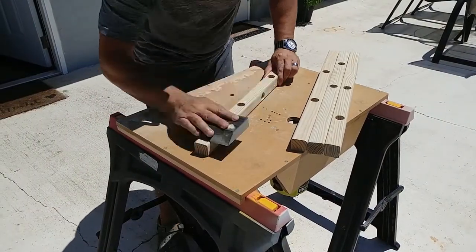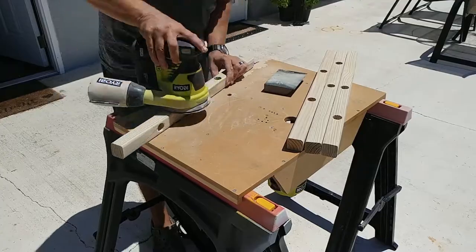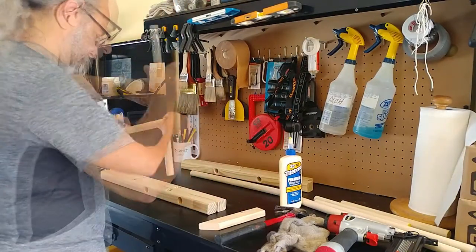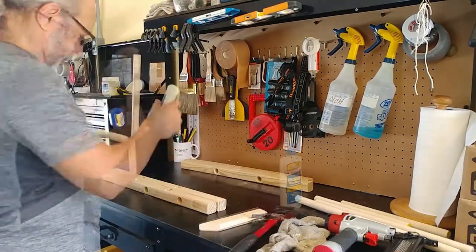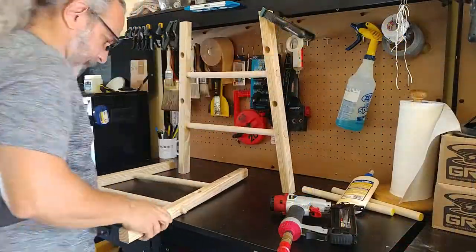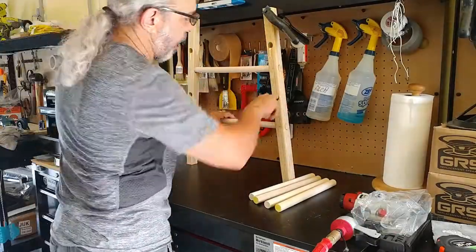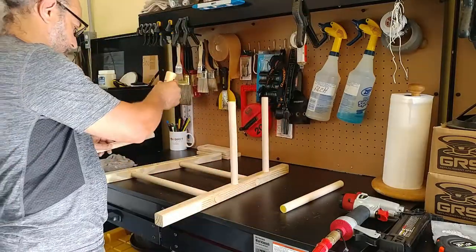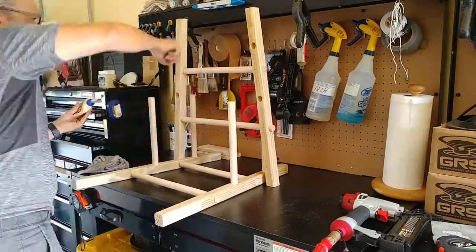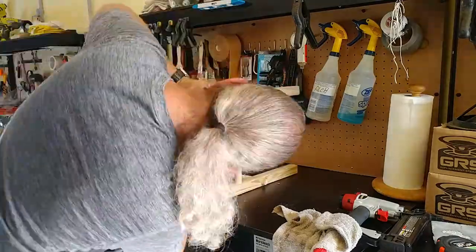Because this is low quality wood, a good sanding is highly recommended, unless a rusty look is what you seek. I did one pass with a 150-grit foam pad and eventually a 220 pass with the orbital sander. For the assembly, all we are doing is fitting the dowels into the holes with plenty of glue and pin nails to hold everything in place while the glue dries — but if you have patience, the pin nails are 100% optional. I use TiteBond II for 90% of my projects, and you have to work fast because it sets pretty quick. If you want a little more working time, consider TiteBond III — it sets a little bit slower and is supposed to be stronger, although honestly I've never been able to measure the difference.